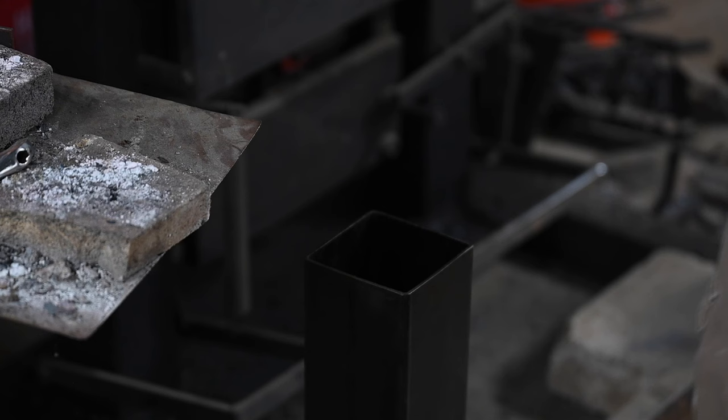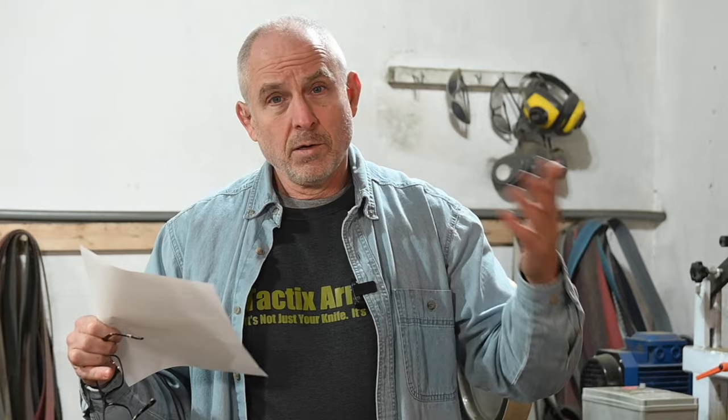The basic deal is: once you harden a knife, you have to temper it, which means going to a lower but still pretty toasty temperature to soften up the steel just a little bit. There's a narrow range of temperatures for any given steel that's going to be effective, and if you exceed that temperature range, you really have to start all over — it's going to soften up the blade too much. Unfortunately Mark, the short answer is you're going to have to redo the hardening on that blade. The good news is that's not disastrous — you just go back, repeat the quenching, heat it up to 1500 degrees or whatever is appropriate for that steel, quench it, then go back and temper it again. All is well.